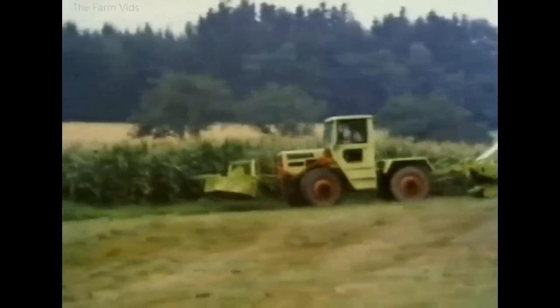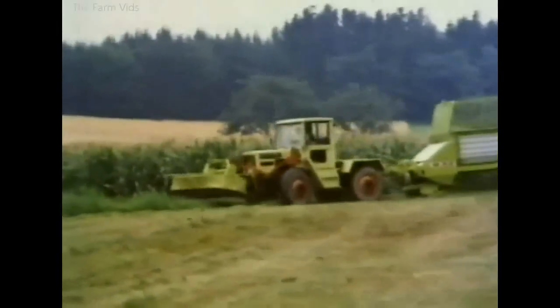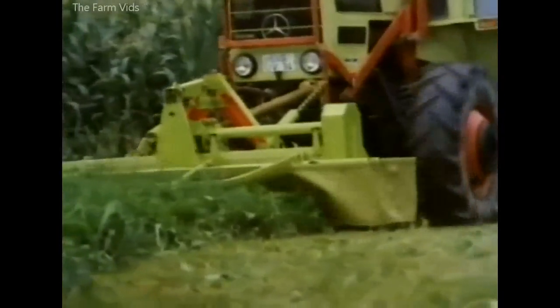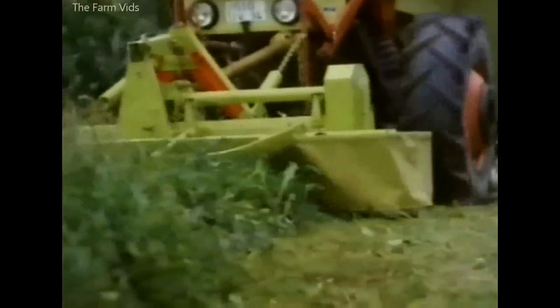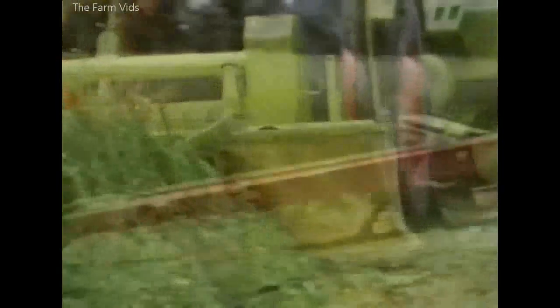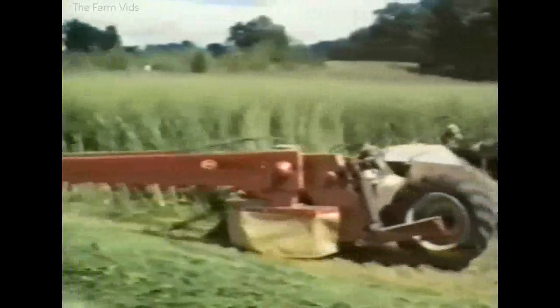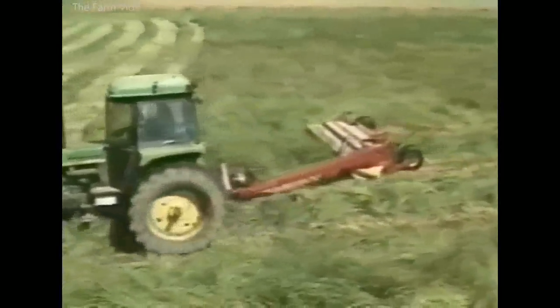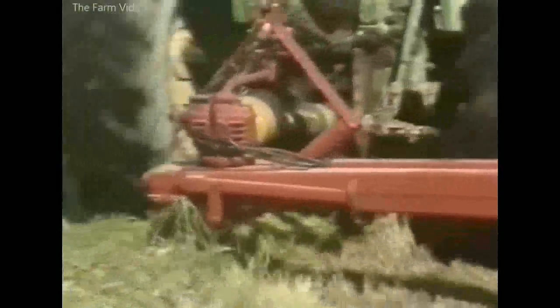Others were front-mounted, and in Germany, farmers often collect grass to feed their cattle with a mower or forage harvester and a self-unloading forage wagon. The Vicon swather cut the crop with a disc mower, conditioned it to hasten drying, and left it in a high swath. The drawbar design allowed cutting to continue while turning a corner.